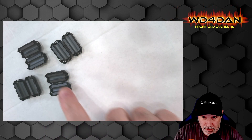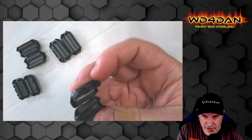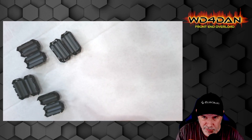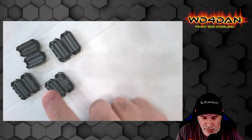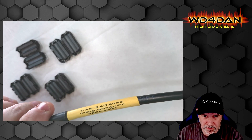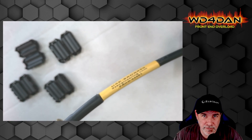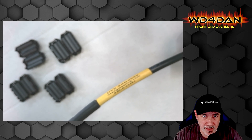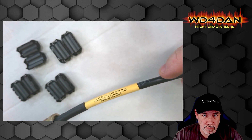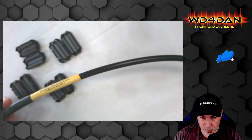Welcome to the desk. Here I have some snap-on Mix 31 ferrite cores — five of them that I'm going to put on. And I have a piece of RG8X, which happens to be from DX Engineering. Now you can get coax with built-on chokes already from the manufacturer — I know ABR Industries has those. You can order a 50-foot run from ABR Industries with chokes already on it, so you don't have to put them on yourself. ABR makes some good stuff. But we're going to put them on this RG8X.